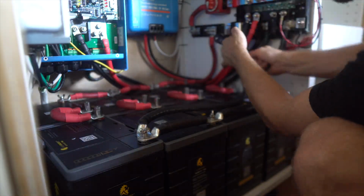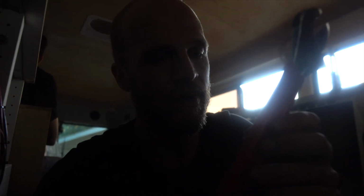I believe we are all wired up. This whole time I've been doing this job with this insulated wrench. You do not want to connect the positive and the negative of a battery like that with a conductor. So you really need an insulated wrench, and you need to be sure that as you're installing this, you don't accidentally take a cable, connect it in the wrong way, or accidentally touch the positives and the negative with the cable.